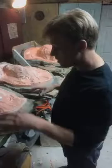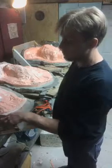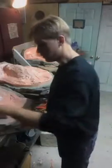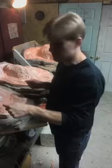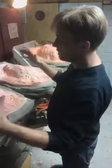So I want all my mold walls to be about 2 inches wide, so when I bolt the two pieces of fiberglass together to hold that silicone tight, I've got enough width for it. I'm going to do a groove down around it so these two pieces snap in real tight and hold the silicone in exactly the right shape. My silicone's thick enough so when I build up and make that fiberglass shell, it's going to hold it and go up against my base.